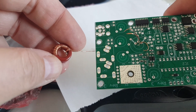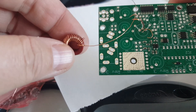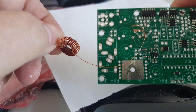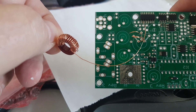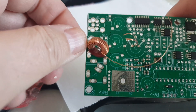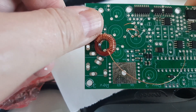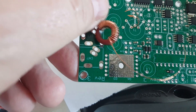The first thing I did was completely mess up the installation of T1. The winding wasn't right — I didn't have the right number of turns and it didn't come out the right way. I had to cut it out. I really didn't like the way it was explained in the manual, although Hans probably writes the best and most complete manuals I've ever seen. But it just didn't make any sense to me the way it was explained with the big loops. So I'm going to redo this — rewire it, redo the 38 turns on this side, then do the three separate five-turn windings. I'll just do it my way.